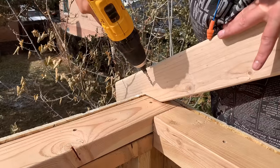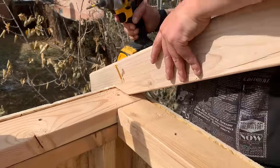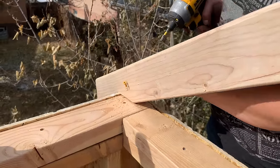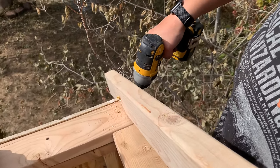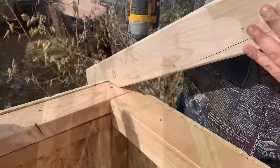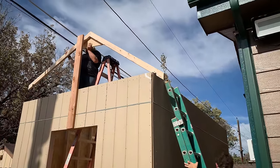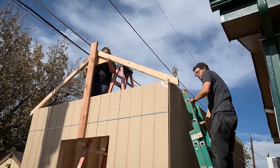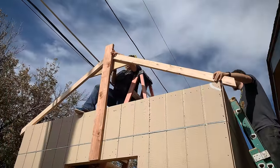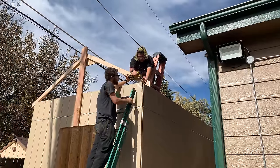On the side of the shed where the truss overhangs, that of course has to go over the siding. Sometimes what we'll do is stop a screw partway through on one side because if you drive it all the way in it'll tend to shift the truss. But if we stop partway through, then put the screw on the second side, we can come back and secure the screw on the first side and the truss won't be tempted to slide one way or the other. Now we're going to repeat that same procedure on the other gable end of the roof — this gable end truss also has just one plywood gusset.